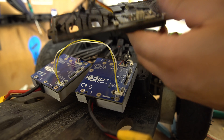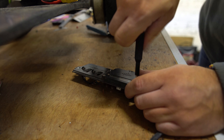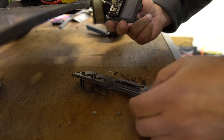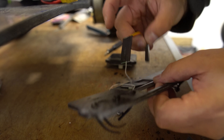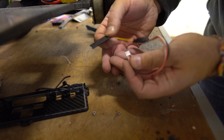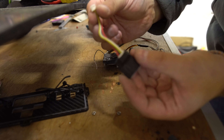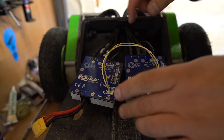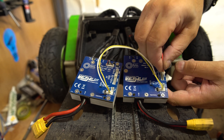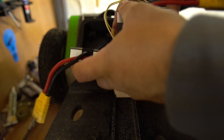In here - the receiver and the dongle are in here, so I need to just take this apart quickly. Everything on the Tramper is put together so well, there was no way that was coming apart. So that's Scott's PPM receiver right there, this is the dongle, and here is the dongle cable - all rescued from the monster box. That's all going to go in here. We have to pick one of these VESCs to be master, it really doesn't matter - I'm just going to pick this one. That's going to have the dongle in it and also the PPM receiver in it. This case was designed so that these wires could stay in and not get in the way, so they slot in there.